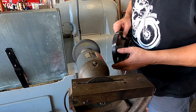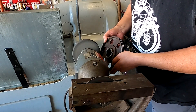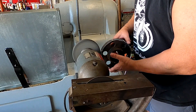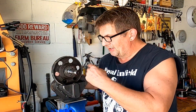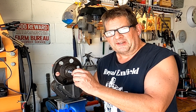Last thing I'm going to do is take out any little nicks and burrs from this gear. This gear's had a rough life, so I want to make sure it's going to run smooth. Okay, I've just been sitting here running this gear over the gearbox to double-check mesh and engagement, and it's spot on. You can do a lot by eye. Brass files out real nice and easy — just be careful you don't take too much brass out when you're filing, otherwise you end up with a thin gear tooth, which you don't want. I hope you all enjoyed this. We'll see you next week. From Florida, Don out.